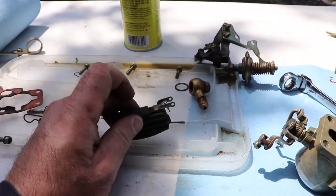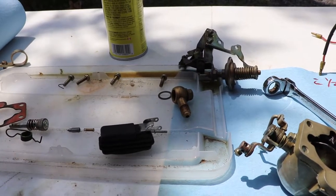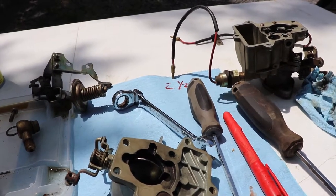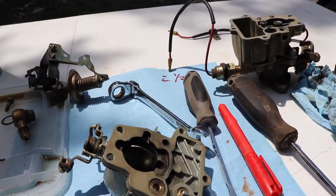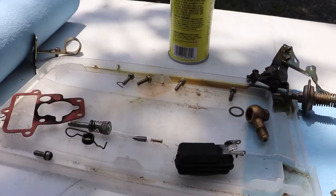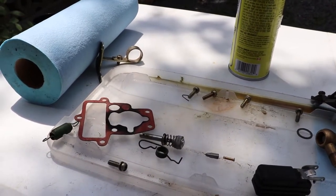I'm not going to adjust the float on it. When I referred to the manual earlier, what I should have said is that there's a really good US Army manual that's available — I'll put a link in the description. It covers this carburetor, the Nissan engine, and a lot of the forklift systems that are transferable across all TCM forklifts. It shows how to take the mast apart and do a bunch of things without using heavy equipment — you can use the hydraulics to your benefit rather than needing a second forklift. Otherwise you'd have to buy about 10 different manuals to get all that information.